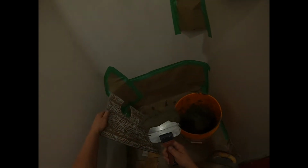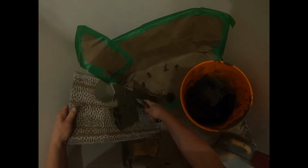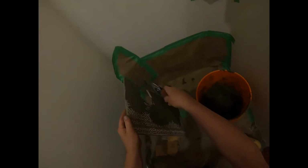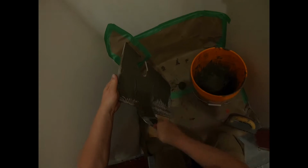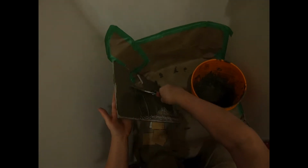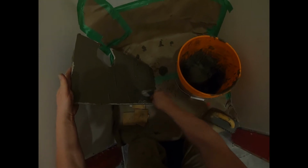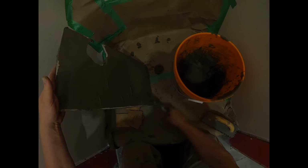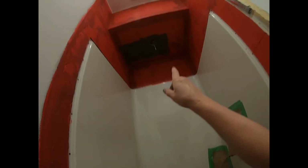And what I like to use to put the mortar on the backs of these is just a 6-inch taping knife. I find I get good coverage with that. Go like that. You don't want it too thick. Just put it on nice and heavy and then wipe it off. Okay, like that. Okay, when you've back buttered the tile, you want full coverage, okay? Just like that, not too thick. And you remember you've got it up there too, so now, here we go.